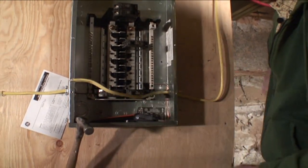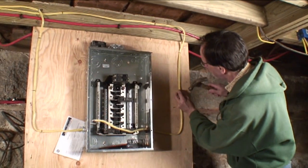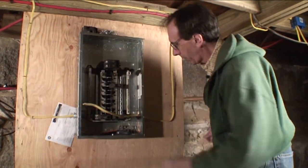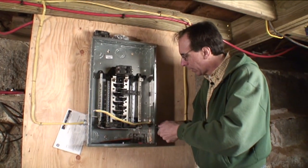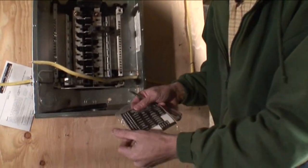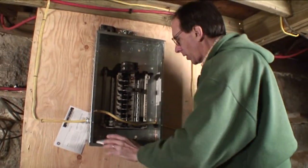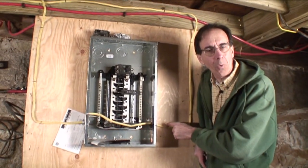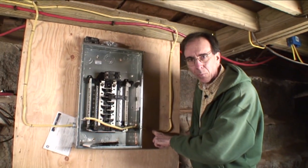I think we're going to have enough wire to do everything we want to do. One thing I haven't been doing yet is we're going to label the circuit breakers. The panel comes with labels — it has a lot of generic names of what everything is. You can also write with a ballpoint pen or a Sharpie on the wire as it goes into the panel, so you know out here what wire it is as well. We want to make sure we know where everything goes, and this is the time to do it while we're putting it in.